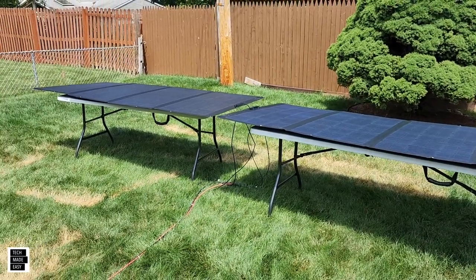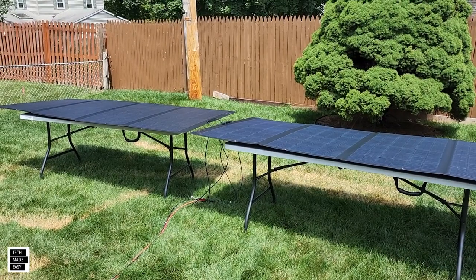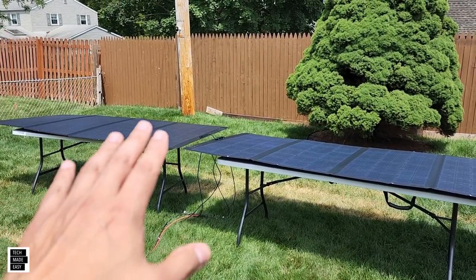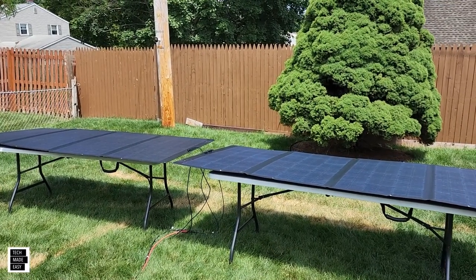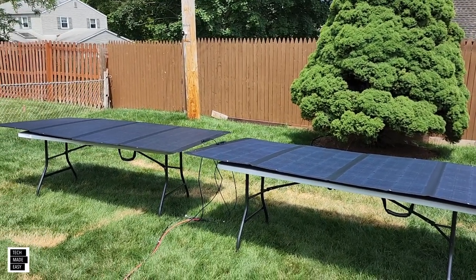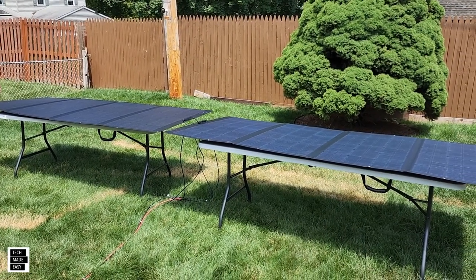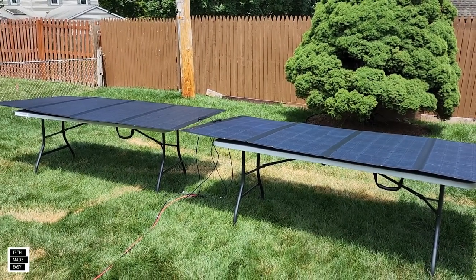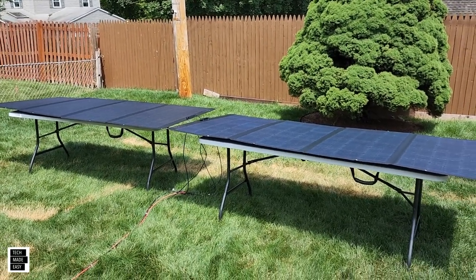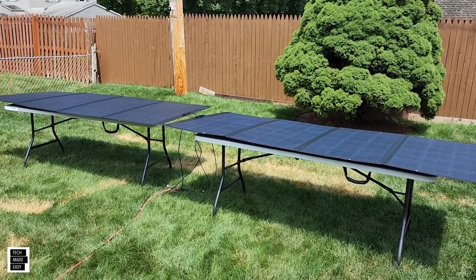So what I'm doing right now is I'm still doing some testing. I'm finding so far, when I'm charging solar while I am powering the house with the smart home panel, again 10 circuits, I'm getting about 2 days of power out of the two batteries and the Delta Pro. Now, that tells me so far that if I got two more batteries and another Delta Pro, doubling, I could probably get 4 days and maybe more.